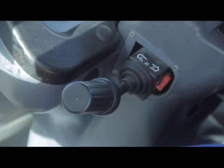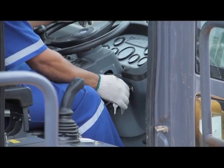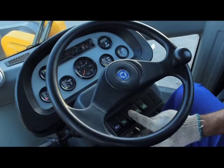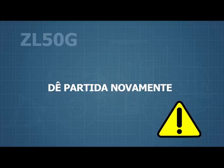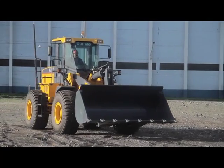Make sure the gear shift is in the neutral position. After starting the machine, allow it to warm up for five minutes in idle position and take note of the indicators on the display panel. If the oil pressure is not adequate within 10 seconds, check for any possible causes and restart the engine.